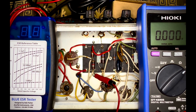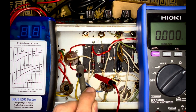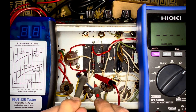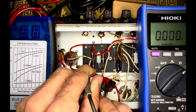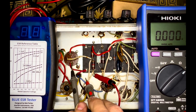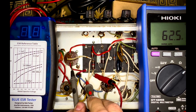Let's check the capacitance of this particular — let's look at these sections. The section connected to this white lead here is the one that's the worst. Let's check the capacitance of this one here, and we're looking at the blue meter on the right. What it's doing is charging the cap up with the internal battery. That's not looking too good. 64, 63 microfarads, which is about three times greater than it should be.